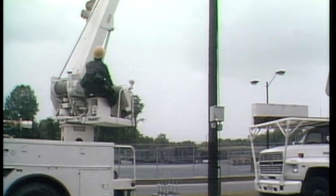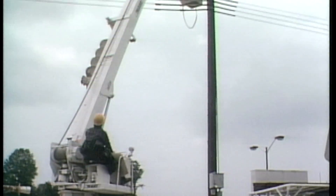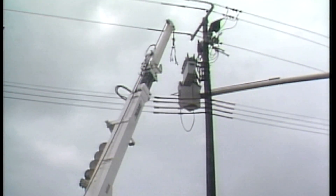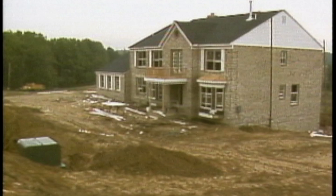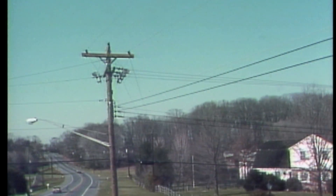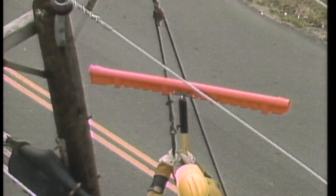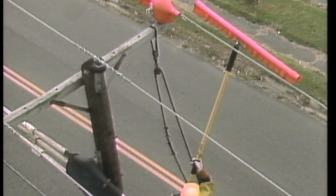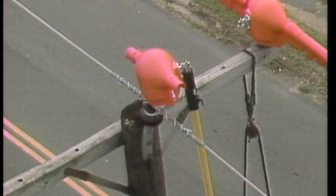The clearance and safety requirements of the job are also a concern during planning. Make sure that you're aware of obstructions, such as tree limbs, buildings, and telephone lines that might complicate the rigging. Often, rigging a job on an overhead distribution system will require working around energized or potentially energized equipment.